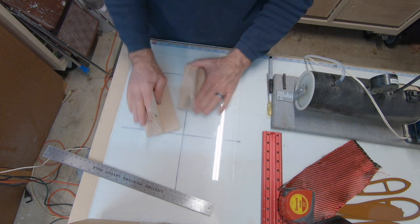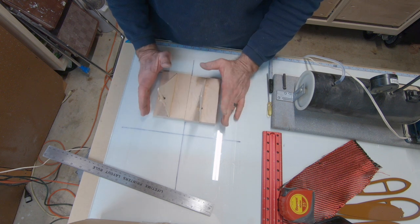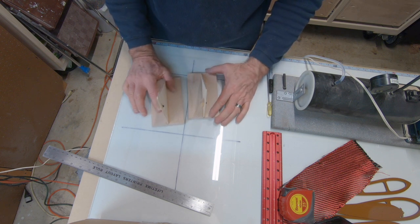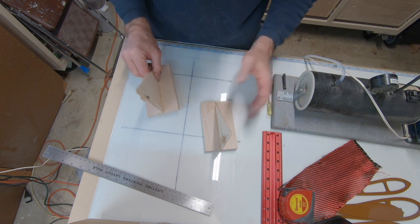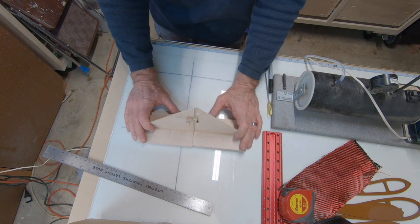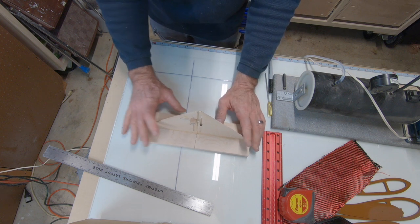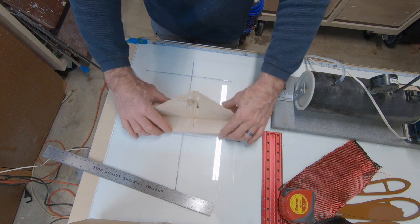So now that you've got these constructed, 16 of them, obviously you've got to batch cut them. I mean, you set up a chop saw, you knock out 15 blocks, you slice up these grooves, you mass produce these plates. And it doesn't take long if you have the right equipment. And you can double check, you can slide these together to make sure you're getting your 90 degree.